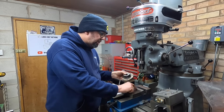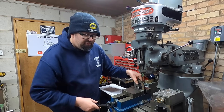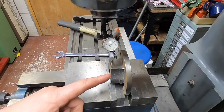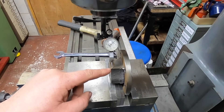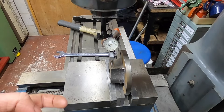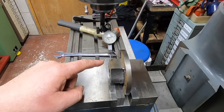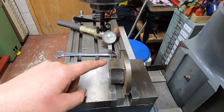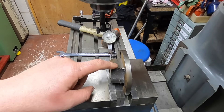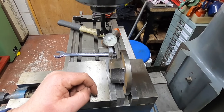These are slightly above the vice jaw and hopefully we can grip it in there. Right, so we've got this set up here. I've zeroed this corner here - if you see, there we are. It's zeroed. So we'll just run across and I'll show you how far out it is. That is saying three and a half thou, which is tiny.